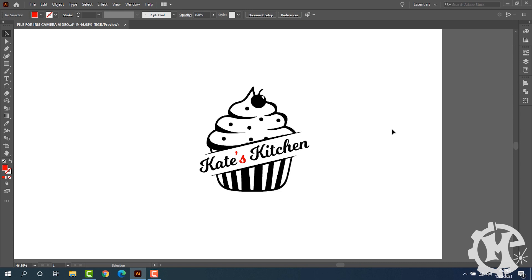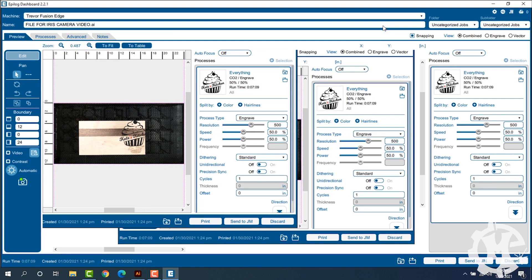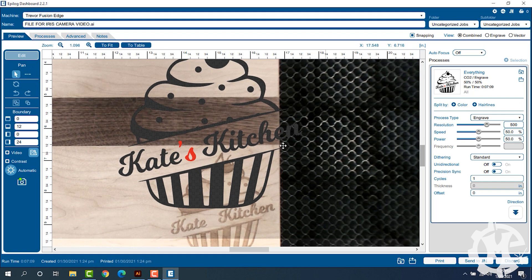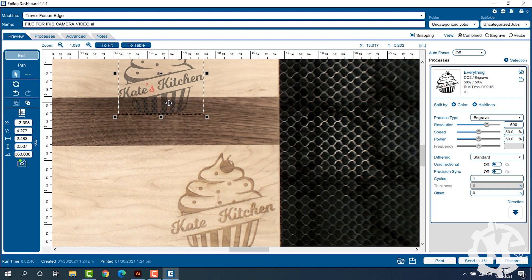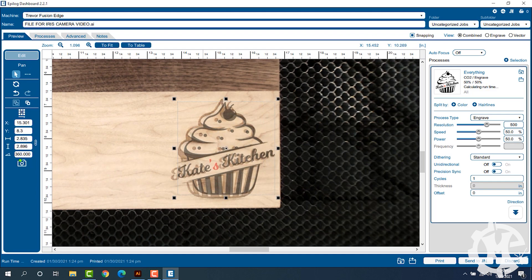Here's the graphic for the cutting board. I added the apostrophe-s in red because that is what I'm going to be adding. When I send this over to the laser I can split the red out into a different process than the black. I'm going to print this and send it over to the Epilogue dashboard. Once it prints, I'll click the video button on the left and the camera will show up. I'm going to zoom in to that area — my graphic is much larger than what's on the cutting board, but I can grab the graphic and scale it to get it closer to the right size.